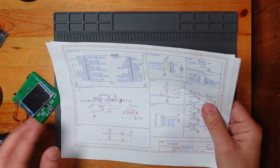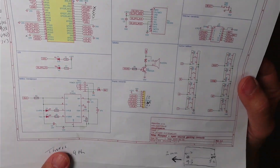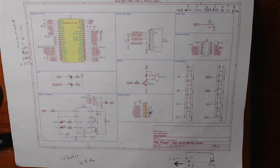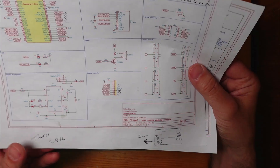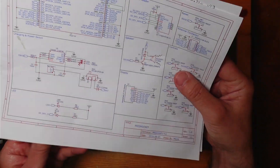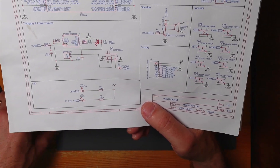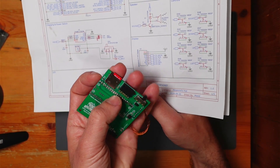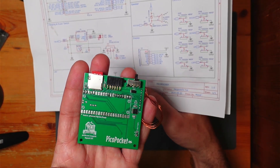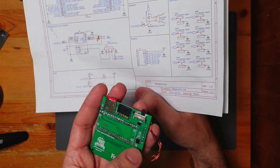It's all based on this — the only sort of hardware documentation available, which is just a PDF online for the Pico Pad. That was good enough for me. I just had to redo the whole thing and changed all the surface mounts. I was hoping I could put the new Pico 2 on there, because Raspberry Pi said it's backwards compatible with the same pin outs.